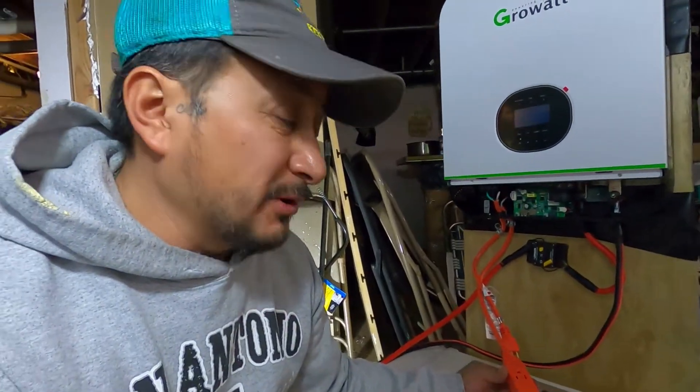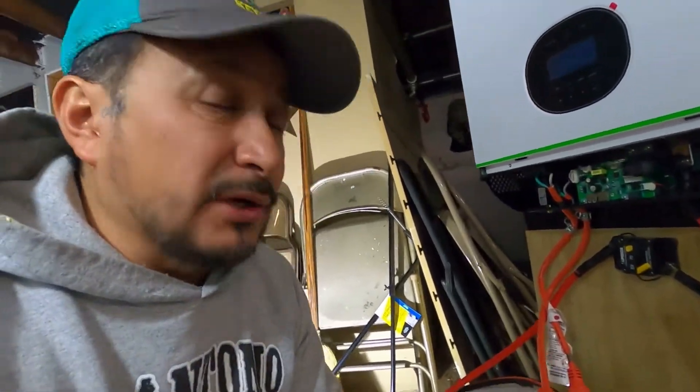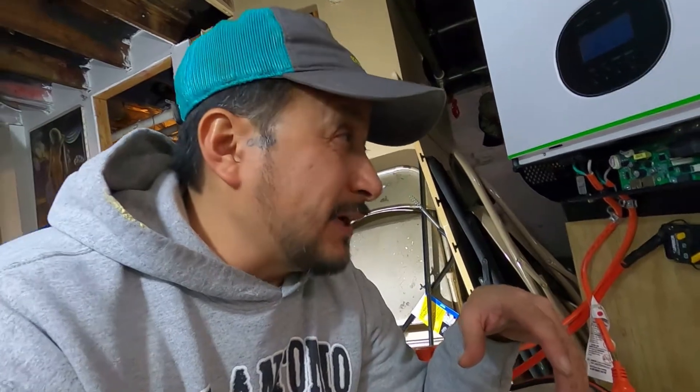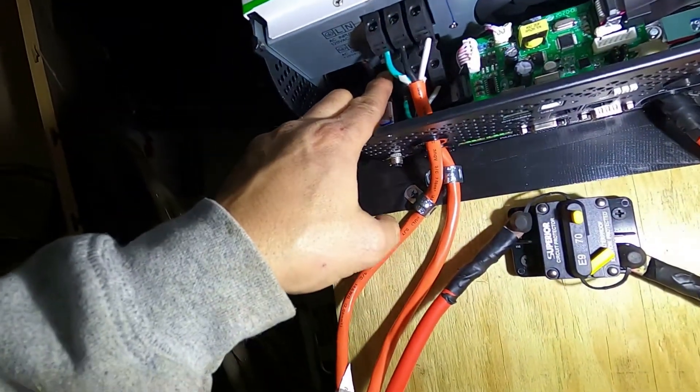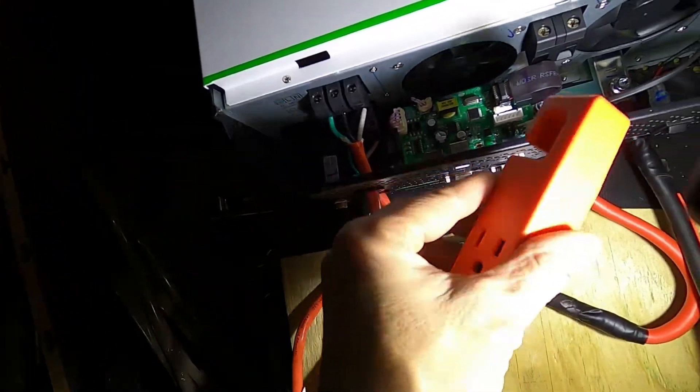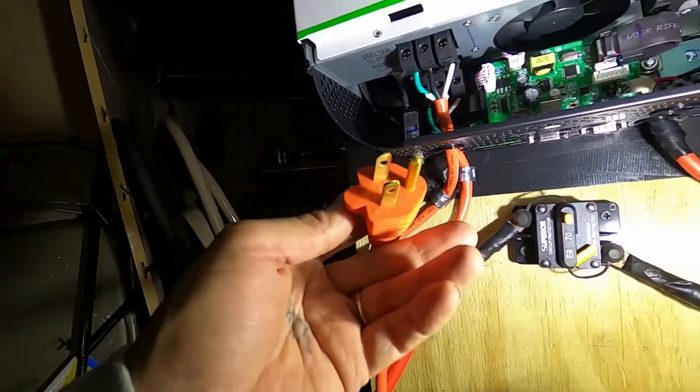So when I mentioned having the TV at the marina, I can have the TV in the back of the van wherever we go and have the 65 inch screen and mirror it. I can also have a phone charger on here. The one in back is for the output — the one in front is going to the grid to plug it in. Now this doesn't backfeed into the grid. What this does is — if this battery's not charged and there's no sun out — it will pull power from the grid to recharge the battery and run whatever appliance you have hooked up. But if you have a lot of sun out, it'll pull from solar first and also charge the battery from solar first.